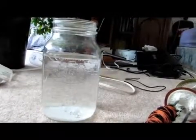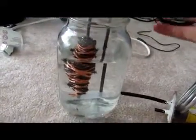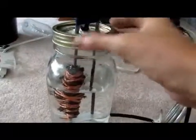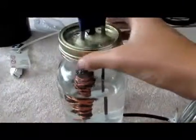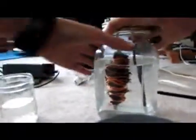We have to wait until the lye completely dissolves before we add anything else. Once it's dissolved fairly well, make sure it's fully dissolved because we want a good electrolyte to start this off. The hotter the water gets, the more conductive it's going to be. Then we're going to screw on our canning jar ring and everything — make sure it's a really good, tight seal.